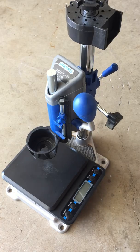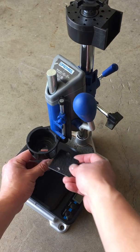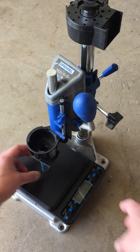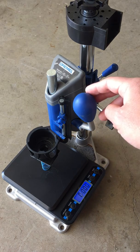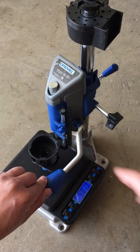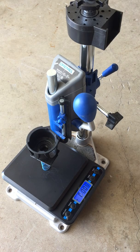What you do is basically stick your spring underneath the press. I use a little piece of carbon fiber just to make sure the bottom of the press is completely flat and I'm getting nice even pressure. Then you turn on your scale — I've got mine set to pounds — and just press it down one inch. At one inch it's reading four pounds and 1.3 ounces, which is right at my spring rate of four pounds per inch.